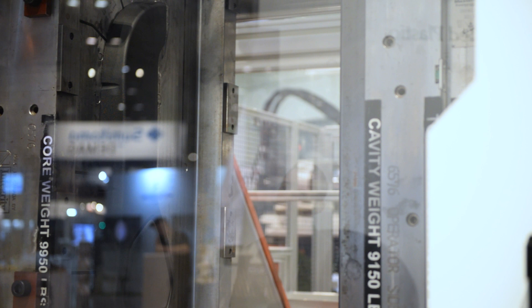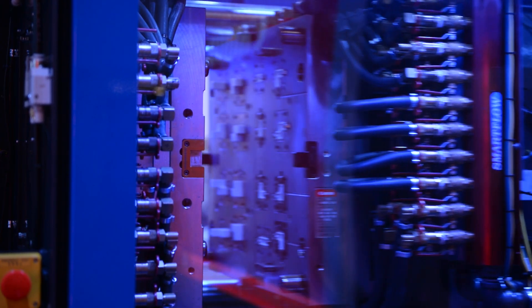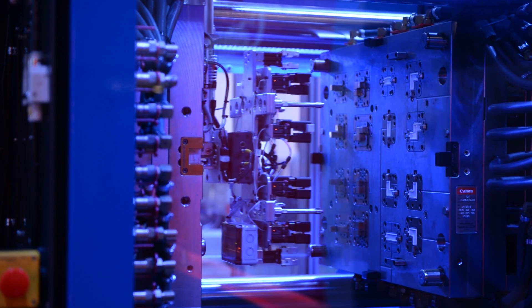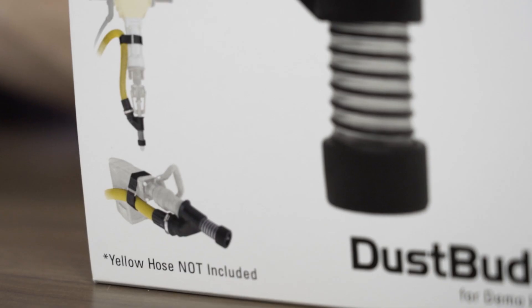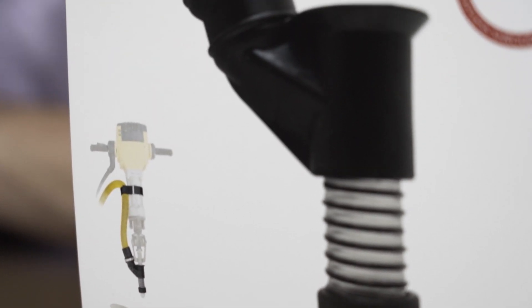Dustless makes some of its components in the U.S., but the largest share of parts are polymer made through injection molding. A lot of those components are made overseas, and most significantly, the tooling for this molding work is almost exclusively made overseas. A mold tool is a significant capital investment necessary to get started with injection molding, and for Dustless, mold tooling was largely a cost driver. This company sells in stores like Home Depot, so its products have to be available at prices consumers expect — which left them going overseas where tooling could be made less expensively.